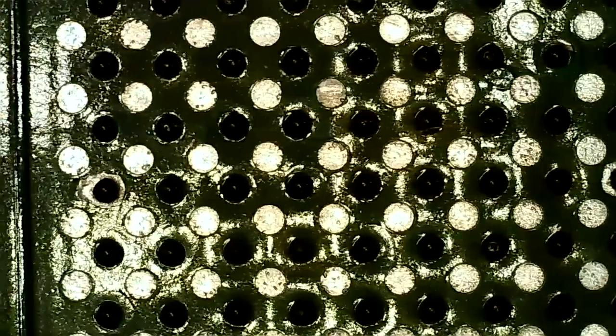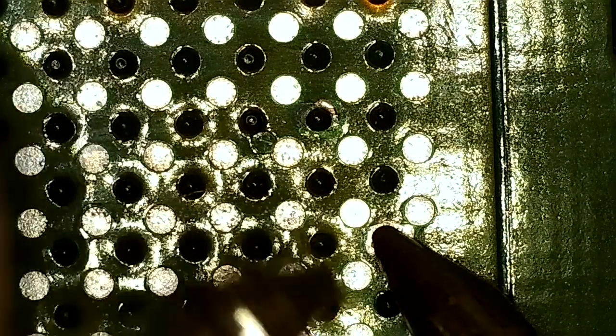I think what's happened is that the solder mask, the original one, wasn't really sitting there, and I probably removed it when I cleaned up. I don't recall how it looked on the footage then, but I'm just gonna check what these things go to, if anything. Turn the multimeter on. Yeah, so those are probably ground around it. So it might be why the solder mask either wasn't there or it's gone missing.